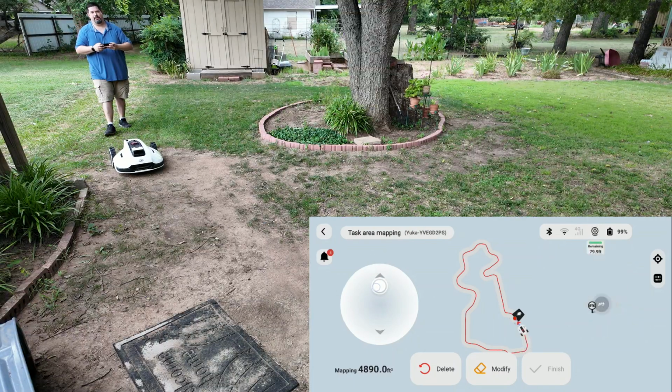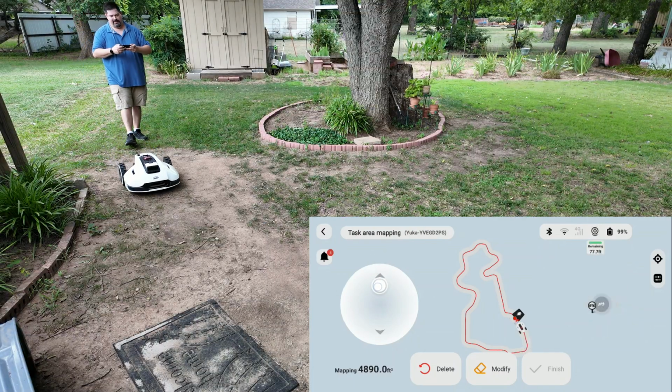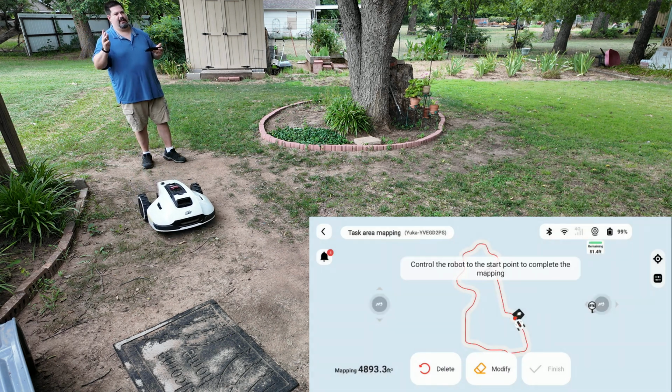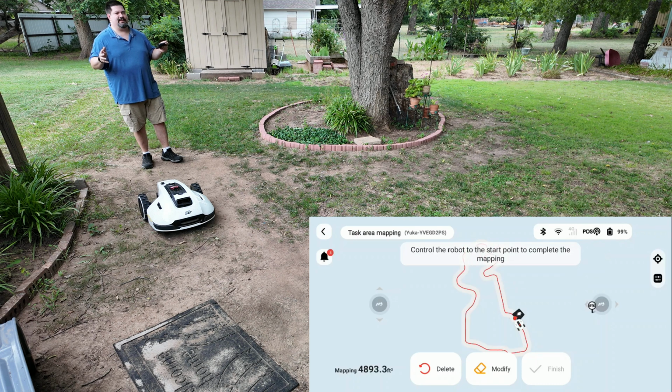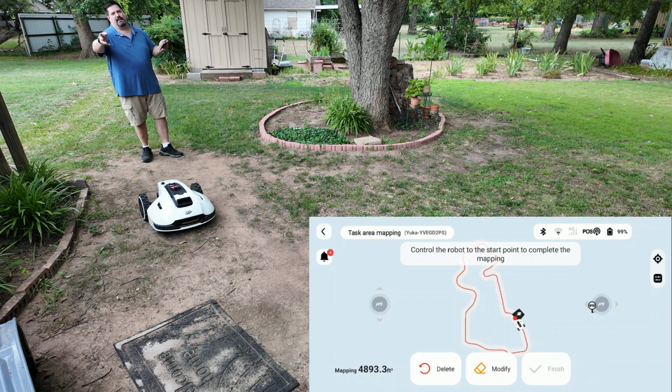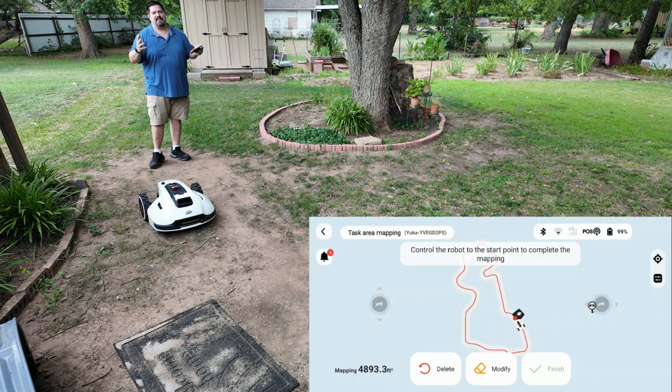So guys, I really hope you understand what we just discovered here. RTK placement is paramount. So you can see I'm under this tree that I thought wasn't so bad, and it was just on vision for a second. So this is where I had the RTK unit, and it is just leaves above me. That was attenuating the signal enough to cause all the positioning problems.